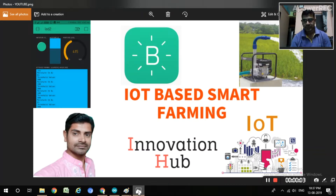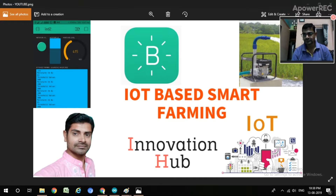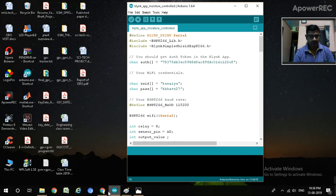Hello friends, today I will upload my new project - smart farming. In this project we can see the live data of farming. Right now I am using the moisture sensor to detect the moisture of the land. We can adjust the threshold level, and from this threshold level we can turn on and off the motor, and we can see it on our mobile phone using the Blynk app.